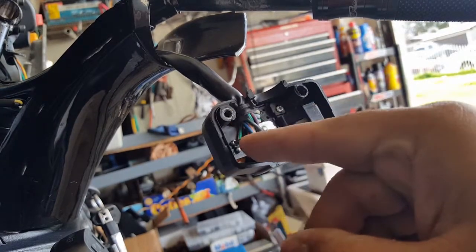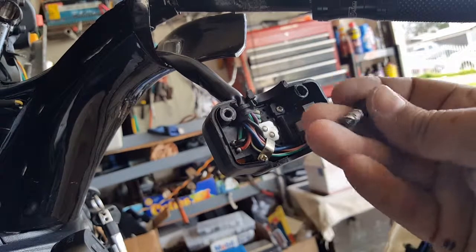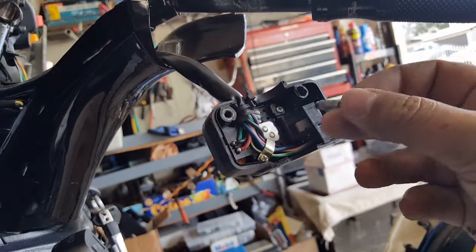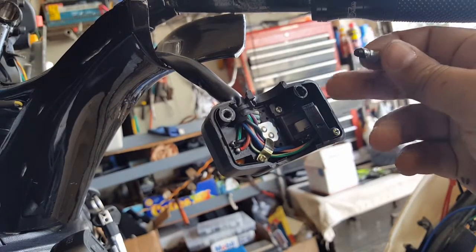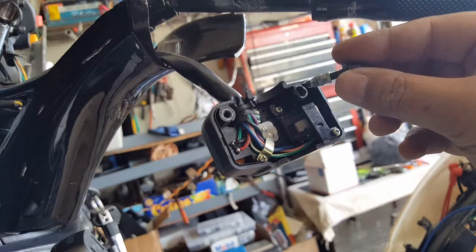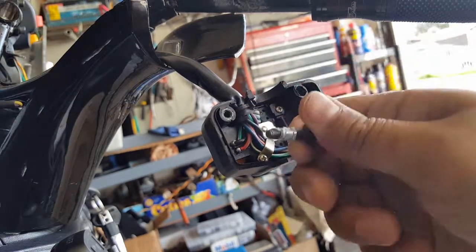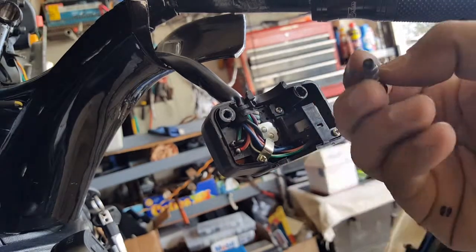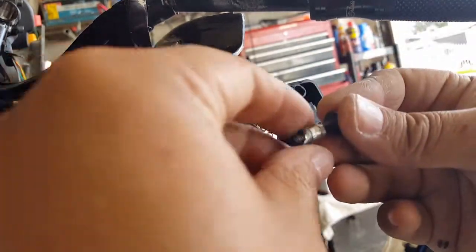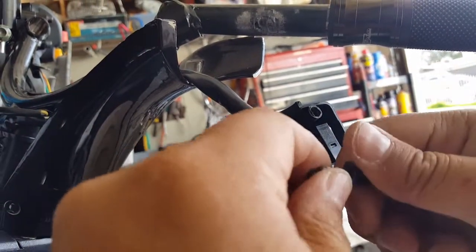So you can see here, it did a number. Maybe the blue Loctite was causing it and pulling it. Maybe we should let go of the blue Loctite in this situation, because it's driving purely into plastic. It's not really a solid metal frame, so maybe there's no need for blue Loctite on these guys anymore, because it looks like it pulls out the whole metal thread, and that's not what we want. We want it to be able to pull out easily and just create a lock, but we don't want it to spin freely.